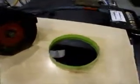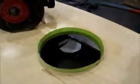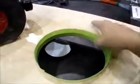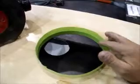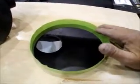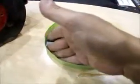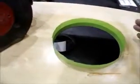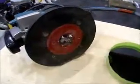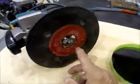Okay, so what I did is I ran some tape very smoothly inside here so the bearing can run up against the tape. The tape's probably 4 to 5 thou thick. If for whatever reason this router bit cuts deeper than a 1/4 inch, which it shouldn't, I measured it. Actually it should cut about 2 thou deeper.